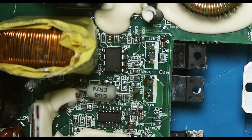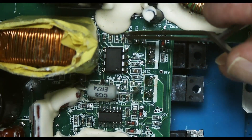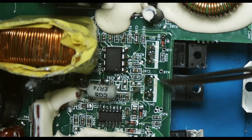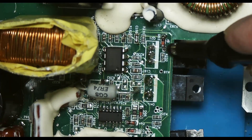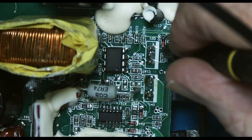Here is an update on the SRM450 version 2. I have changed the capacitors — one of them is to do with the timing of the chip, and the other one is feedback from the MOSFET. The other PWM is where I can bring this frequency down to about 68 kilohertz. At the moment with 18 volts applied, the oscilloscope is showing me a square wave. It's gone up to 90 kilohertz now — it was 38.